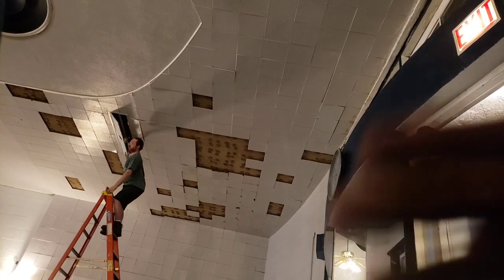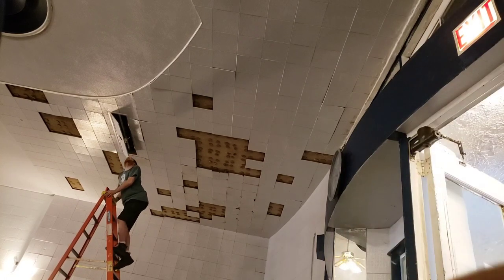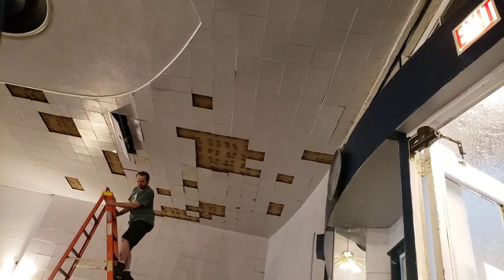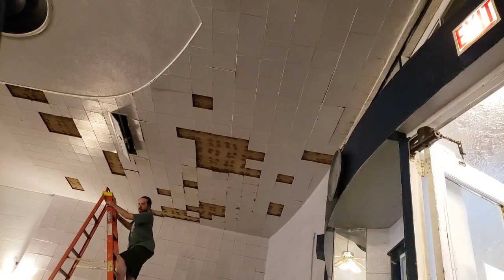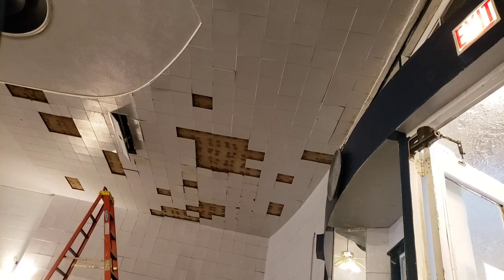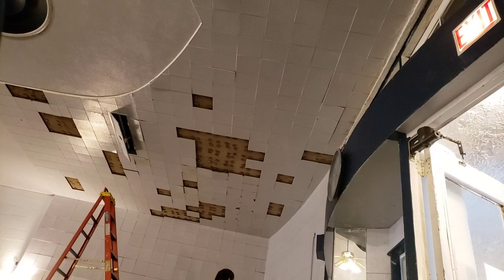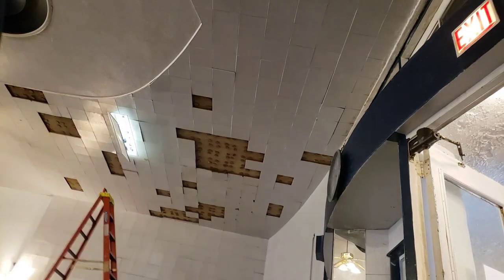Okay, attempt number two. I put one starter and no good bulb in the other, the next best. Okay, a 40-watt fluorescent tube is about 2,300 lumens. So four of them, assuming that the troffer doesn't degrade the lumens any, which it would, because those are recessed, so we're talking about 9,000 lumens. So it is a significant amount.